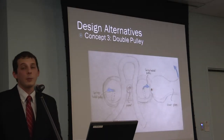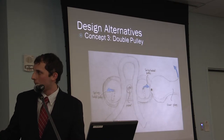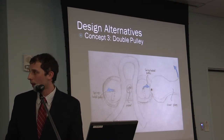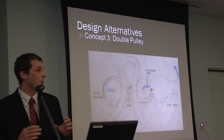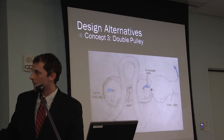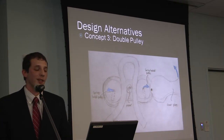The double pulley concept is pretty close to the final design. It features one drive motor in the middle and two pulleys on the outside, which are spring-loaded to accommodate ropes of different diameters — the spring allows the pulleys to move laterally. A cover plate swings to the front to guard the pulleys while running and prevent tangles, acting primarily as a safety feature.